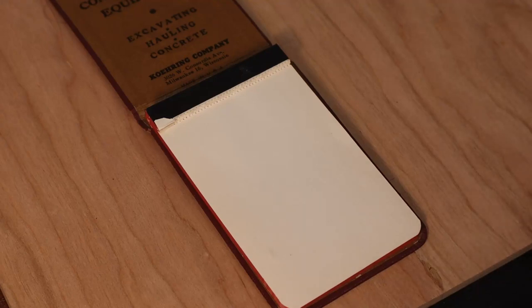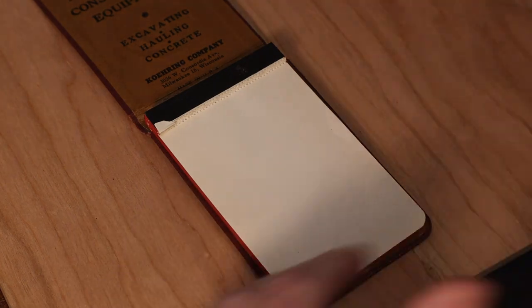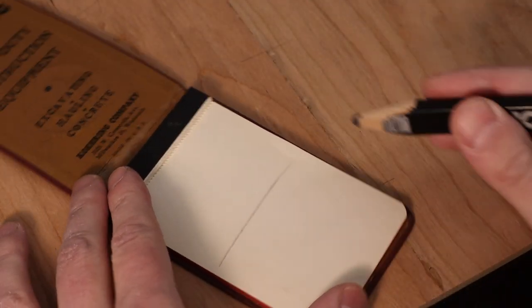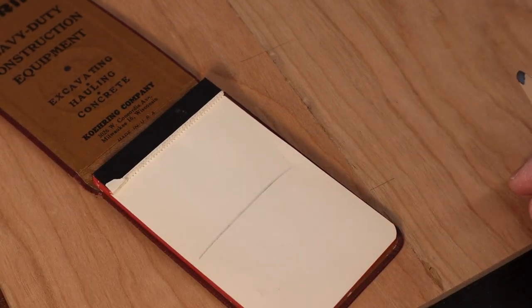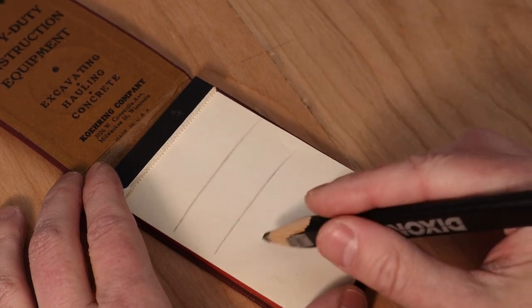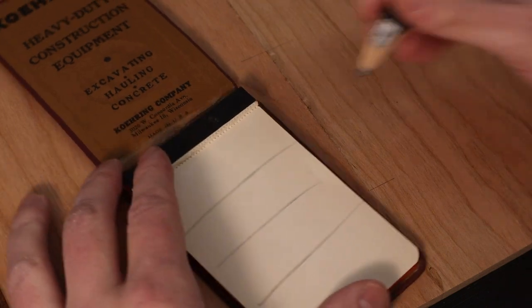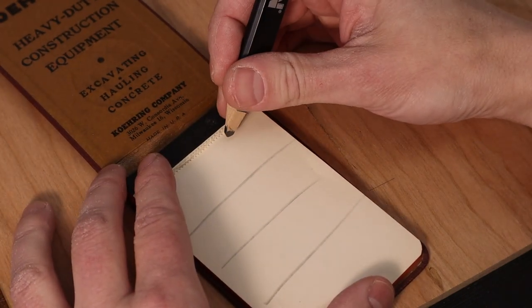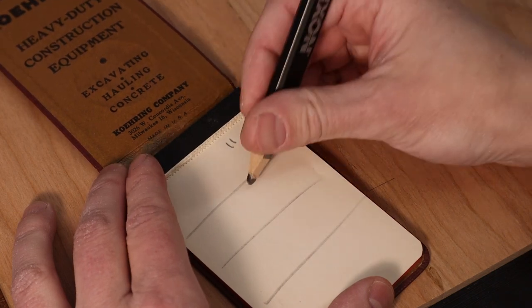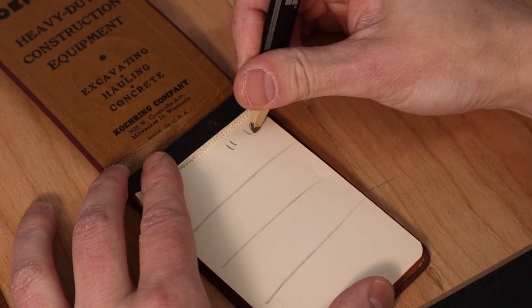All right, so at this point, what I like to do is get a little piece of paper and make a visual representation of the case that I'm dividing up. So what I'm going to do is draw a horizontal line, and that's going to represent the middle of the three drawer dividers. And I may as well draw in the other two as well. So there's my middle one. Remember that the average drawer height that we just calculated is rounded off to 11 centimeters, and that the height of each of these horizontal drawer dividers was 1.2 centimeters.